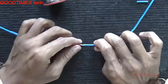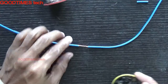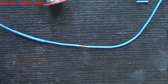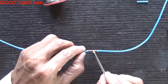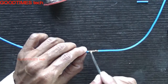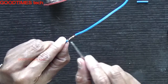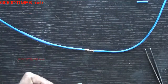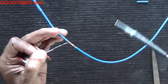Before twisting, you can apply soldering paste. The paste I am using is one I have used a lot. Apply soldering paste so that if there is any insulation or corrosion on the wire it will be melted out.